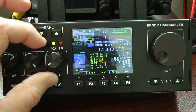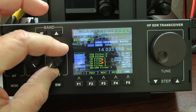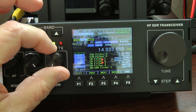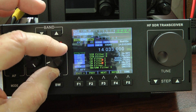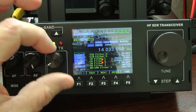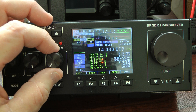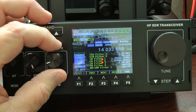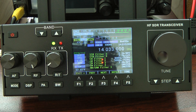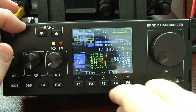You can change these — they are customizable. The problem is you can do 300 and 700 hertz, 300 and 650 hertz, 300 and 800 hertz, so you can customize those. But if you want to do the 500 hertz, 700 hertz is not available — only 650, 750, and 850. I happen to like the 750 hertz tone well enough that I just left that at default. And then I also set up a wider filter of 1.6 as a bandpass filter.